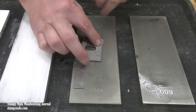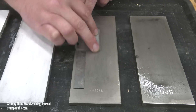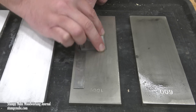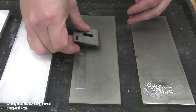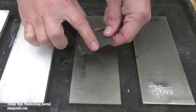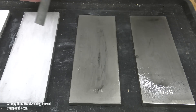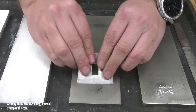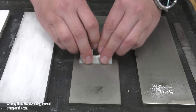Place your iron on top, back side down, and then slide it from side to side. The ruler lifts the iron just a tiny bit and it concentrates the pressure just where you need it, all along the cutting edge. This way, it just takes a few strokes and the burr will be gone. The 1000 grit process is no different from before: you feel for the bevel, you pull backwards, you reset, and you do it again.